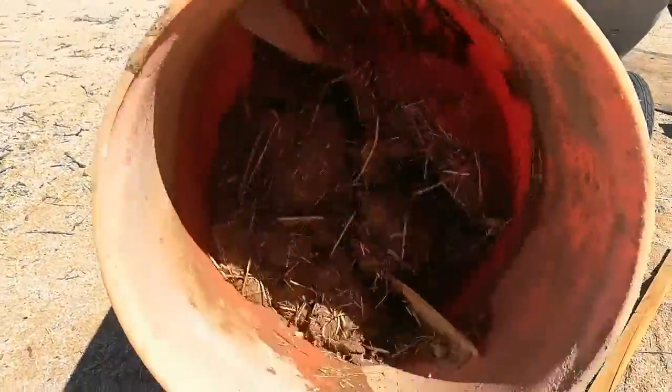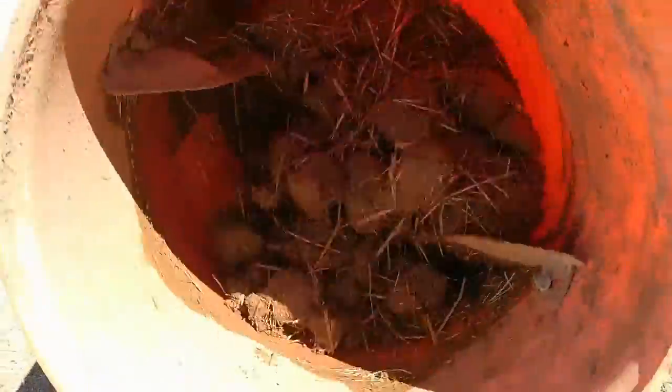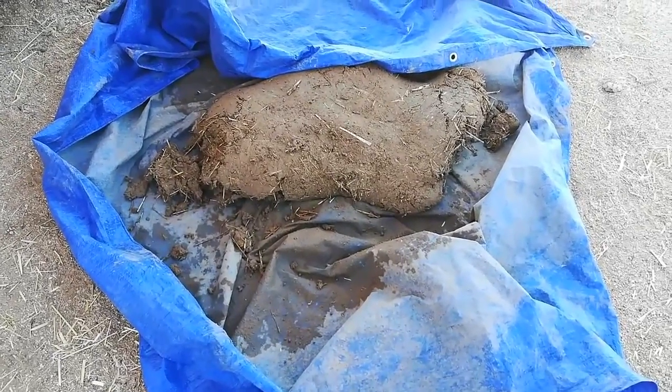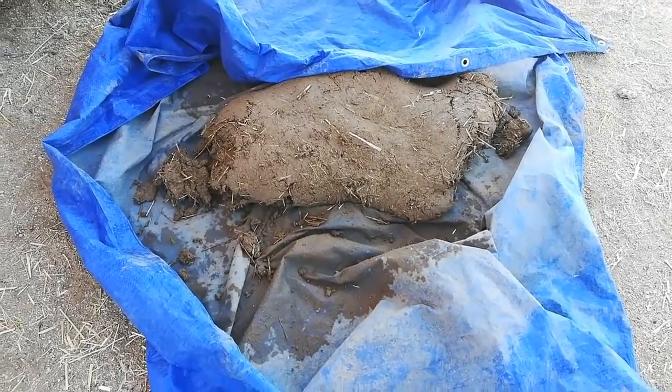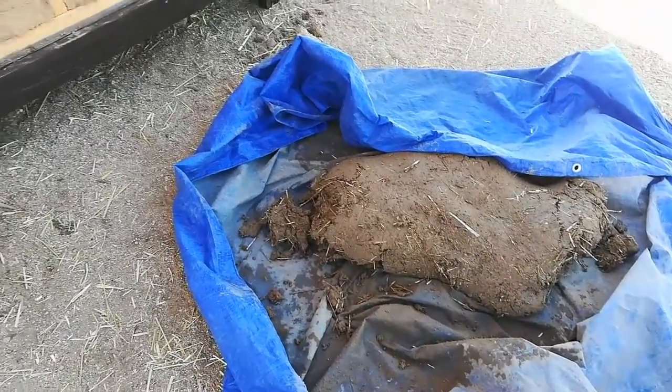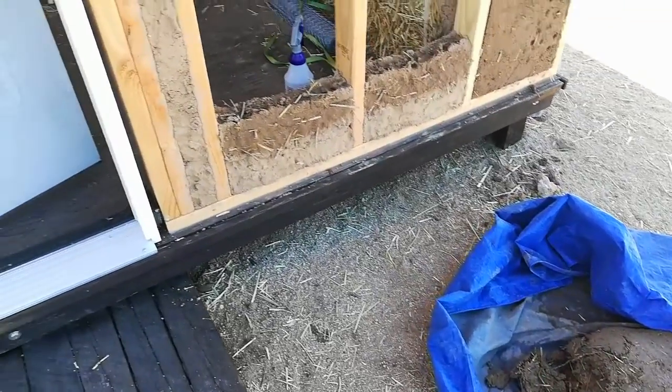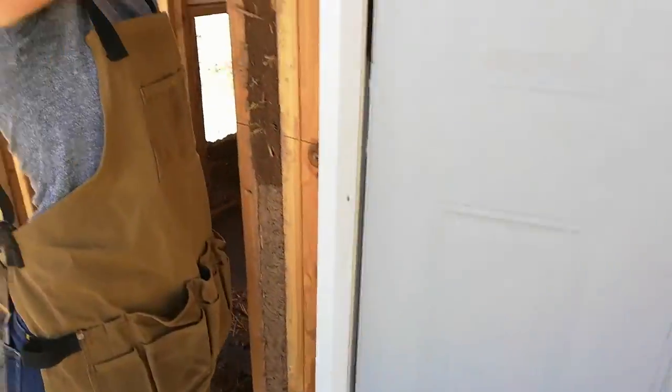This is the second batch. It's been going for less than five minutes, and this is just an incredibly easy process by comparison to the tarp method. What we have in here now are two buckets of dirt, one bucket of water — sorry about the wind — and three handfuls of straw. It appears as though I added a little more straw than the first batch, but Yvonne says it feels the same consistency. It's just a little different because of the straw content.